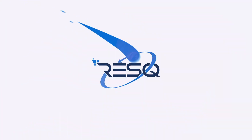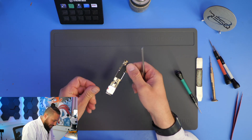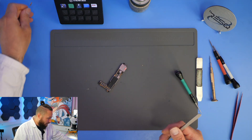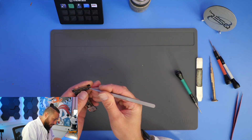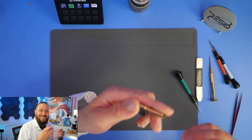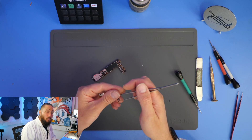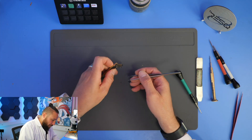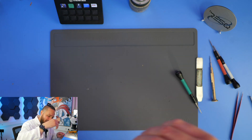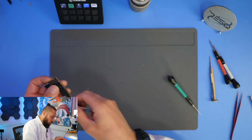We will directly start with that thing here and I want to show you how to solve that easily. If we separate these boards because we have a board-related issue, often we can see that the pads between the board halves look a little bit black. If you go over with flux and solder and desoldering wick, the problem is that you can't get away the dirt on the pads.